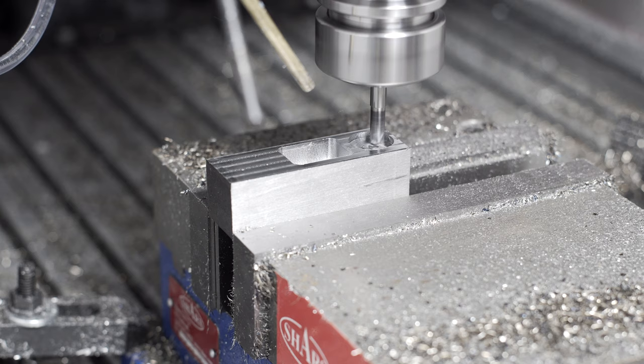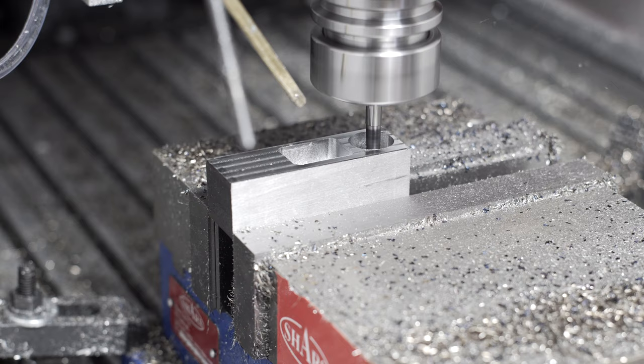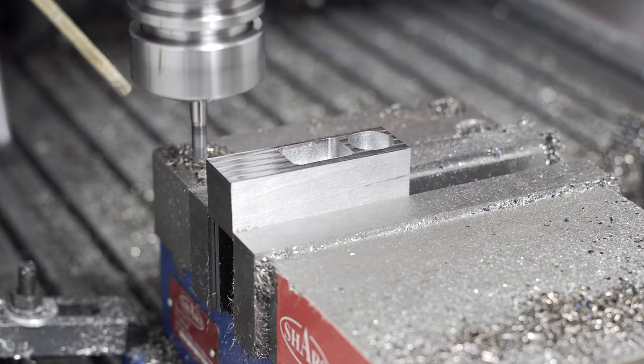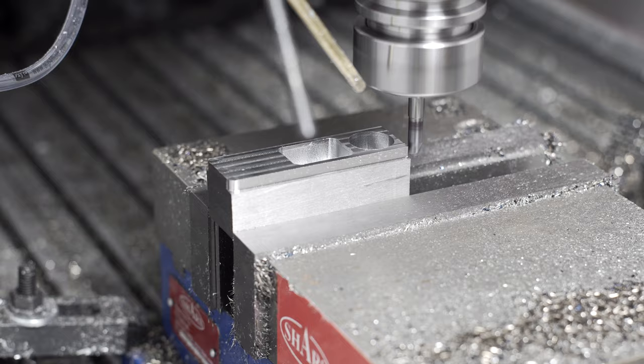Third, and I think this is most interesting to me, is that we still need a rigid machine to run these end mills correctly — it's not a panacea. We don't need the rigidity in the sense of resisting tool deflection and cutting forces in a radial direction. But what we do need is rigidity of the frame to accelerate and decelerate quickly and accurately, which is also something that's lacking in a small benchtop router. On paper, a perfect fit for these little router machines — in practice, probably not so much, given the high feed and acceleration required.